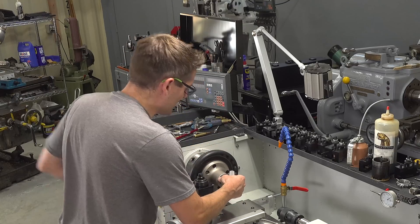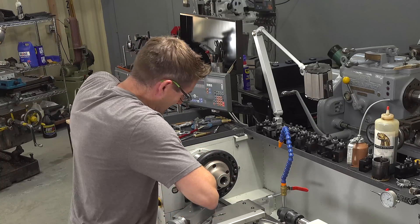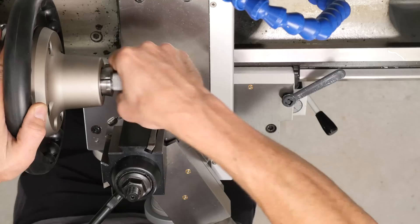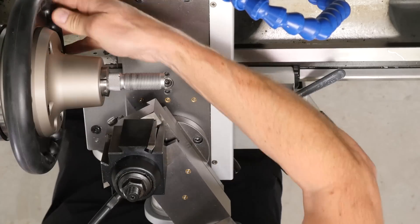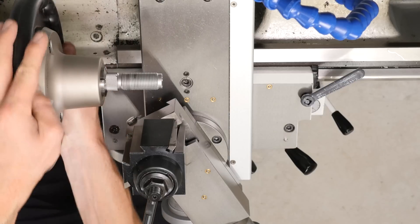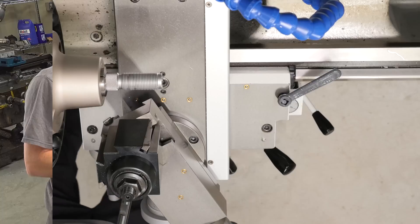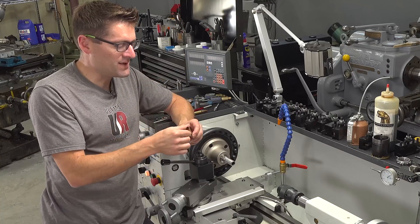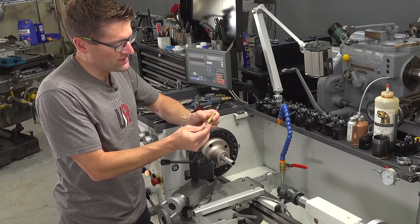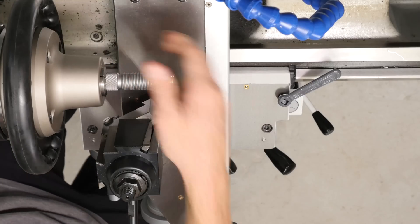This can be a little stubborn sometimes. Sometimes I'll need to take the collet completely out and put the knurled section in because it's very tight. Then we can put the collet back in. Sometimes the die will just slip straight in, but other times you have to manhandle it just a little bit. I like to use collets because they grip really well and they run really concentric. That looks dead on. The cartridge I'm working with today is 300 PRC. This is a once-fired case from my 300 PRC full custom. I'm just going to check my bullet slip — the bullet slips really nicely in there, so that'll work well. I'm just going to insert that into the sizer and give it a good push.